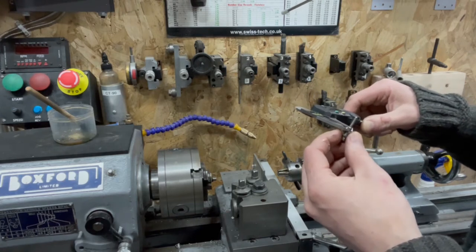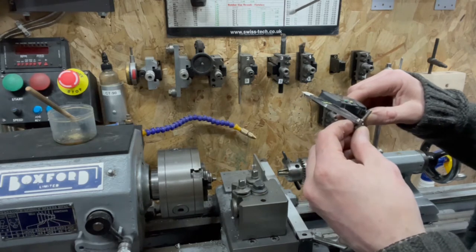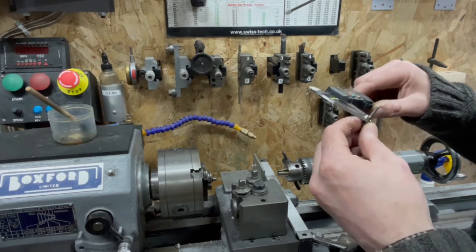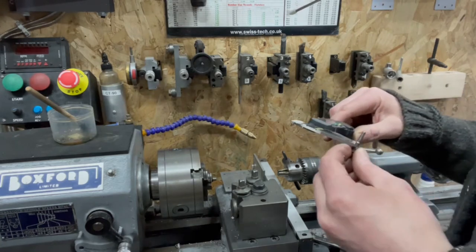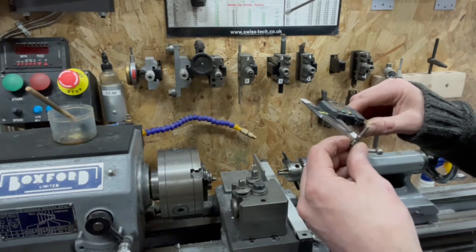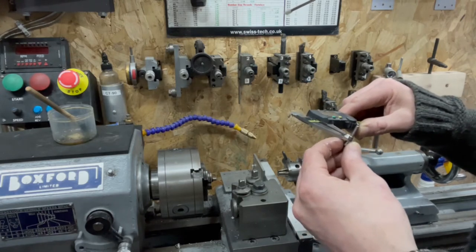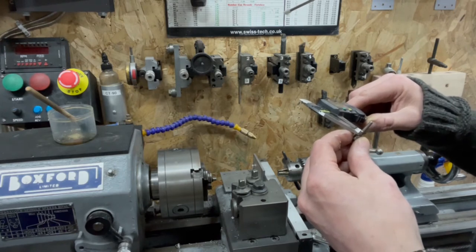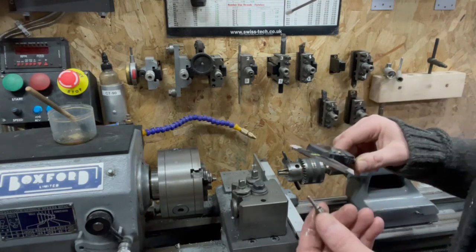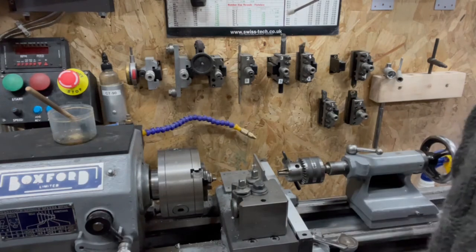So the big side is 4.2. And the large hole, which looks like it's been mashed through massively. I don't know if the hugeness is intentional, so it's got lots of wiggle room and slop so it's not going to jam, or if it's just been made really, really, really badly. It looks like 5.3. Should we go 5.3? Which is still gargantuan compared to the pin. Let's go 5.3.